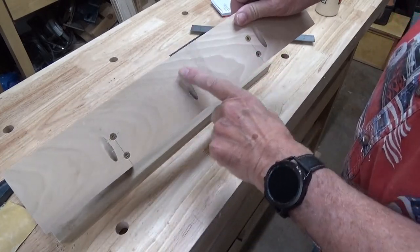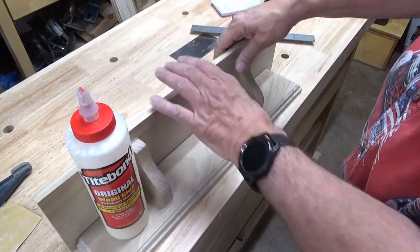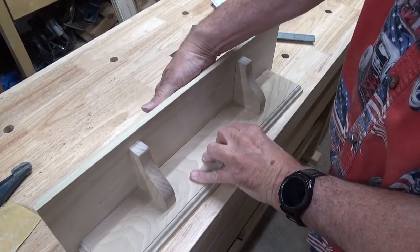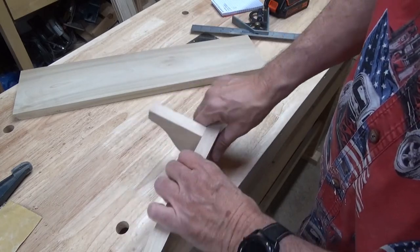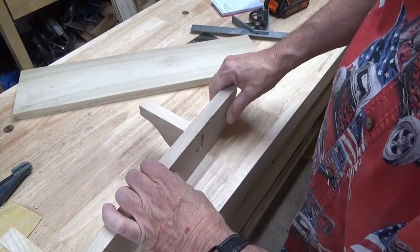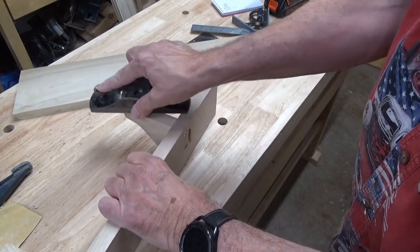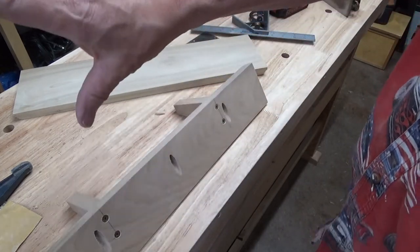I'm going to put two screws into the back of each of these supports, and it'll be glued on the top but screwed and glued to this backer board. I got these screwed in here, but now that I know it's fitting properly, I'll pull the screws out and add a little bit of Titebond glue - these will be on here permanently. Take a look at where these meet - you really want a good joint here, smooth, so that there's not a big gap. But if there is a slight gap, don't get after it with a sander because you'll ruin this flat edge we created with the table saw. Instead, take your hand plane and just gently dress that if you need to.